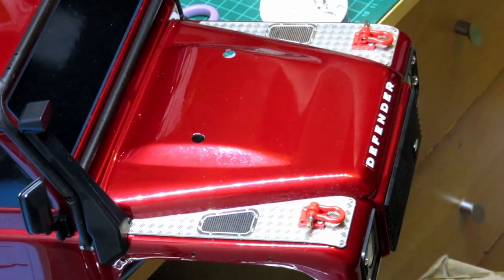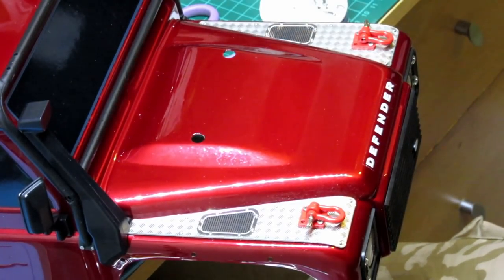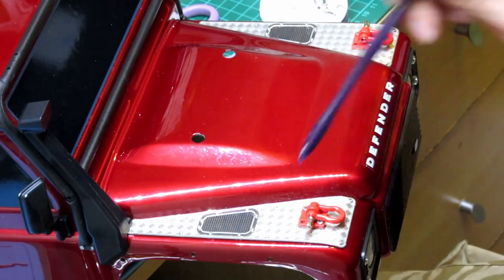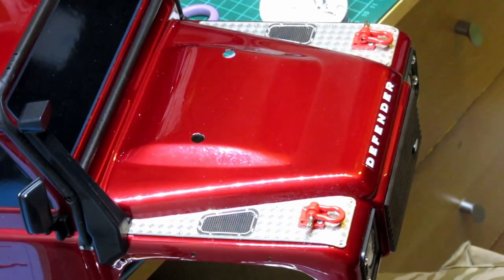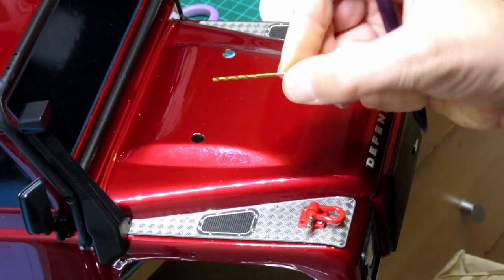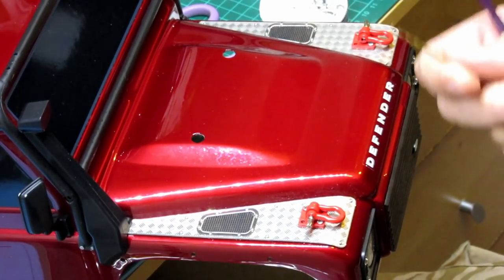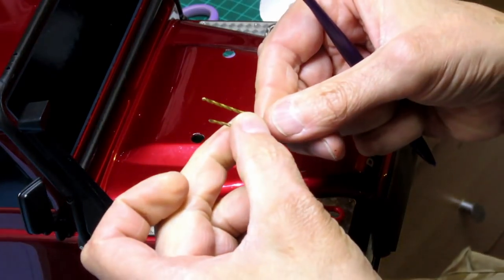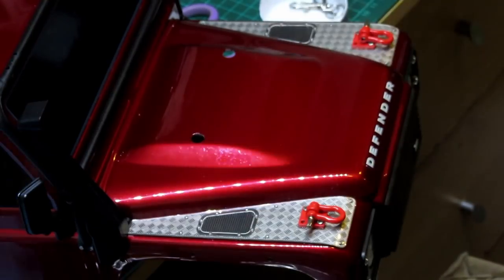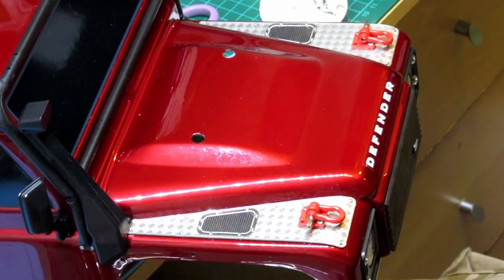Get that magnet off there. It's strong. It's definitely not stainless steel. Yeah. I think it's titanium. And the reason why I think it's titanium is because I couldn't drill the bloody thing. I used normal drills. And we use these titanium coated drills, and these just weren't even touching it. And the brand new drills, and I've got different ones. I've tried different ones, so it's not as if one was a bad one, because these are small, and one was a bit blunt. I've tried different ones out of the packet, and I drilled a piece of steel with this, no bother, straight through like butter.